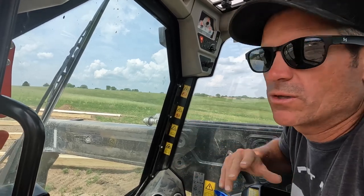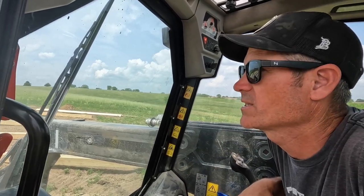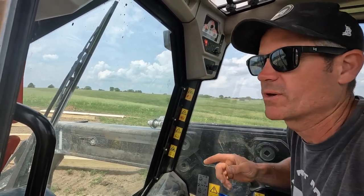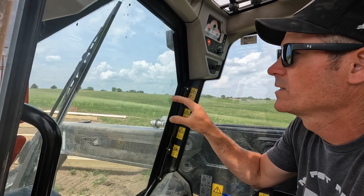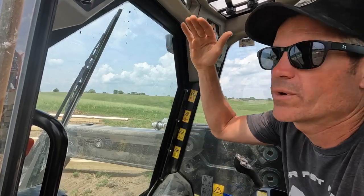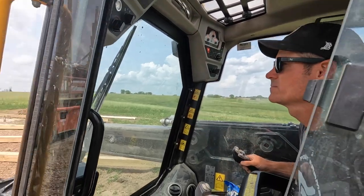There's such a slope here, I'm just going to stand one column at a time, and then we'll cut our boards and work our way up. But if we get measurements, we know what our board length should be. We just push and pull those columns, working all the way up to get them all even.